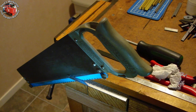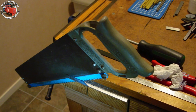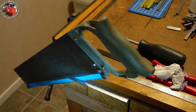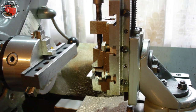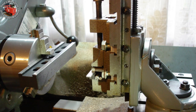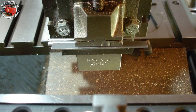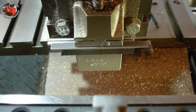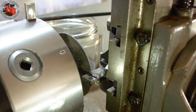Starting on the eccentric strap rods. Cutting a strip from 1.6mm steel with the Eclipse 55 sheet metal saw. This is how I set it up to fly cut it: using a parallel in the chuck to align the long edge. A piece of tool steel under the job supports it farther than the vice can. The cutter will be cutting on the down stroke. Cutting off the fork ends that will connect to the expansion link — these are half an inch long.